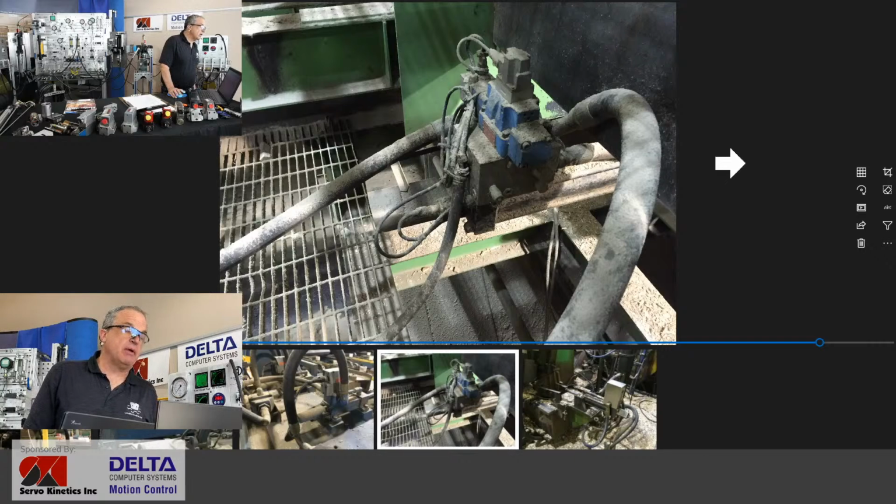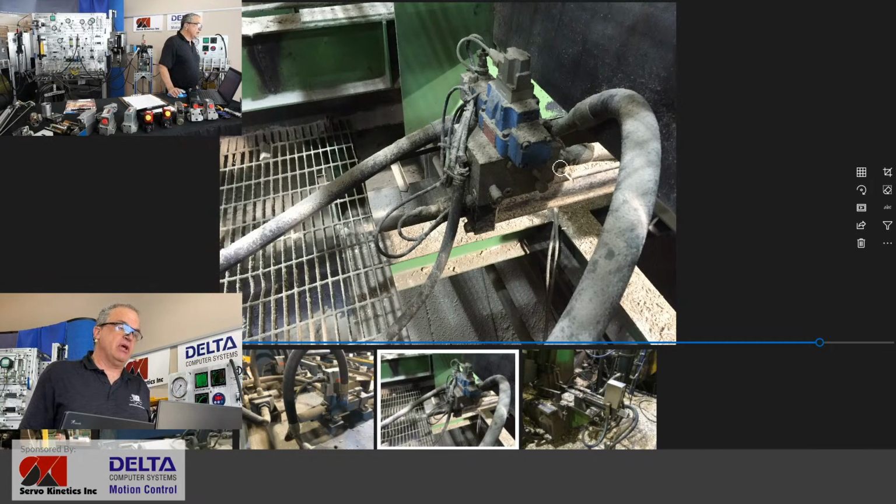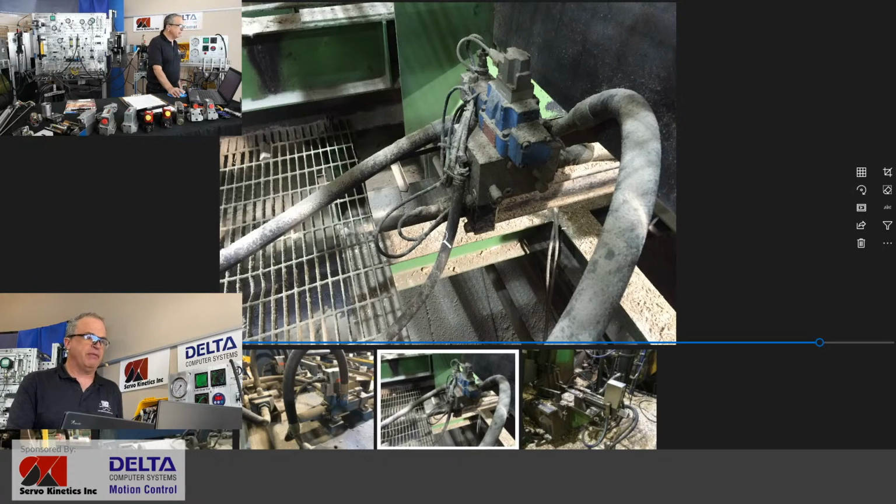And one more example of a servo valve. The servo valve is located on the cylinder, a very large cylinder, but here is another example of a 3-stage. So we've got a torque motor, an output spool, and then a final 3rd stage output spool for a very large amount of flow going to a very large hydraulic cylinder. And we see the MDT perhaps covered in a bit of dust, but there it is down below.